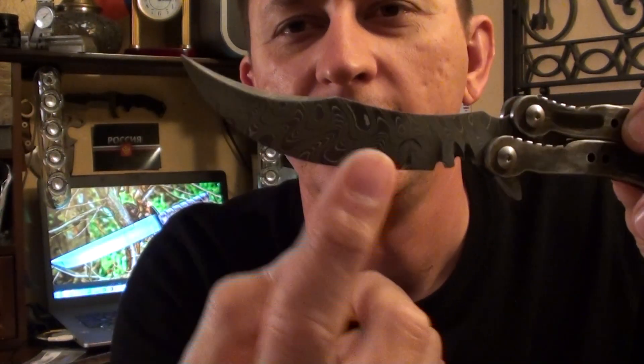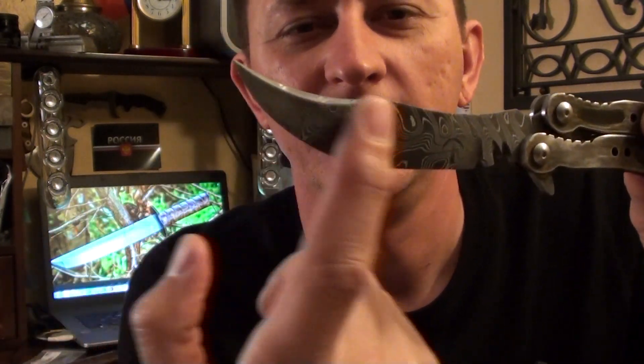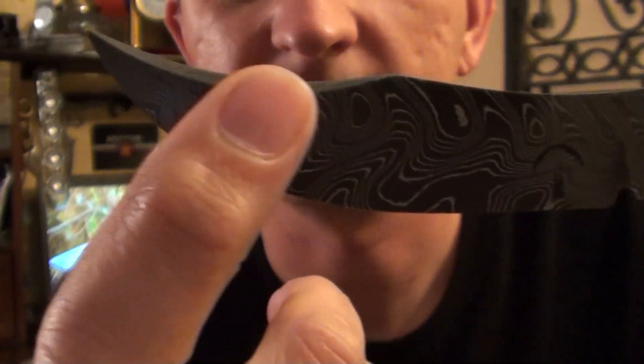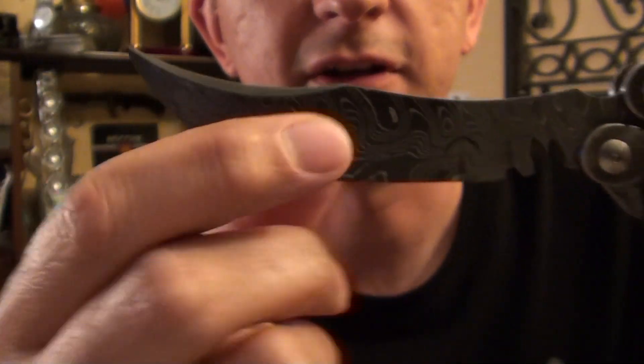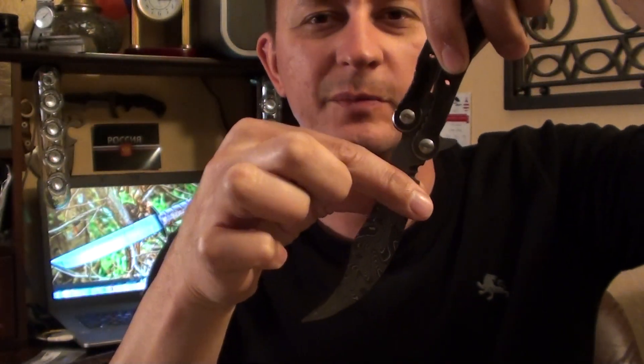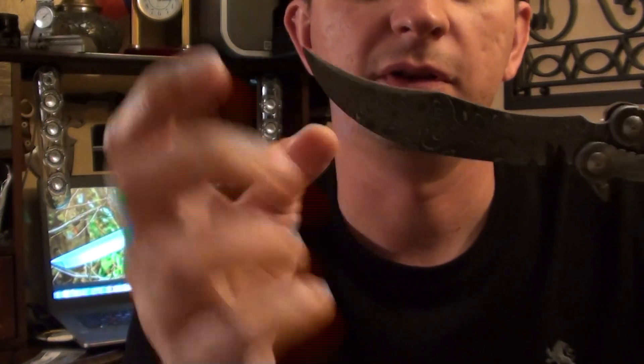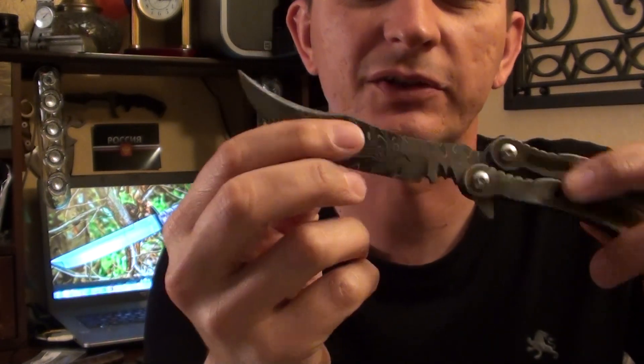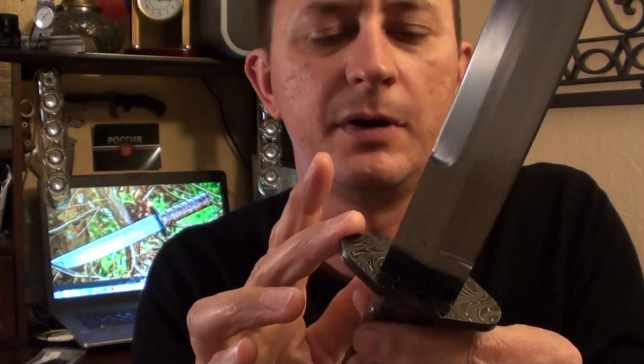Let me show you. When I made this Damascus butterfly knife, notice this is the part I dipped into the oil — you see how it's darker here and lighter here. This part was heat treated and this wasn't, because when I dipped it in the oil, the oil only went up to here. So this part etched very well and this one only halfway — it doesn't have that nice deep color. Make sure you heat treat your hand guard and pommel.